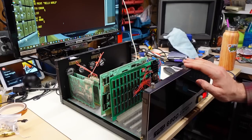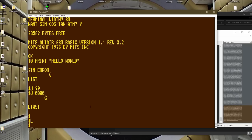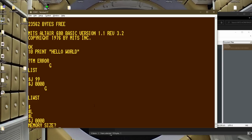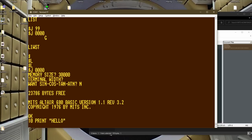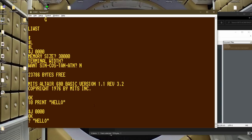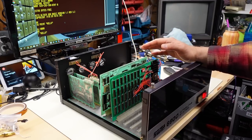My only thought is maybe if the RAM has a little bit of garbage in it from when you power the machine up, Altair BASIC has a problem with that — maybe the RAM needs to be completely cleared out first. I'm not totally sure, but I do know that sometimes this works perfectly and other times it just does this. As I keep reloading BASIC into this thing, maybe I need to do the mod to switch to 9600 baud just so it loads a whole lot faster. Let's try this one more time — if I have to reload it one more time, I'm going to do that mod.